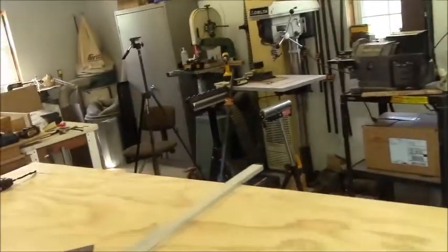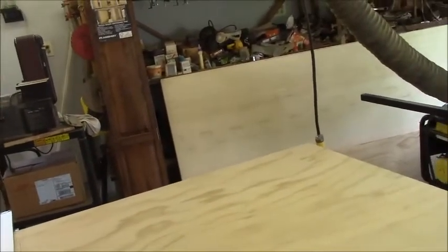The gears have shifted a little bit on the kitchen cabinet project because we need to get the base cabinets in first. And the most complicated base cabinet is that 45-degree angle cabinet in the corner where the sink's going to go out here. So I've been laying out mathematically, drawing right on the wood to try to decide where my cuts have got to be.